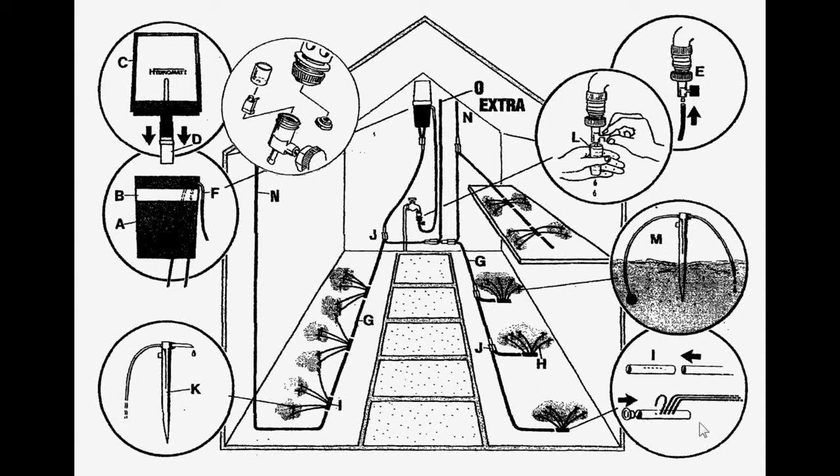From here you have the distributors — a piece of pipe with five holes where you put the drip tubes inside. It's also an extension feeding: you have them here, here, and here, in line with the feed tubing. On the other side, we've used Y pieces and distributed the feed hose further away. It's the same piece of feeding, but in this case we've added a plug at the end.